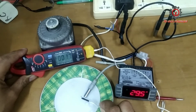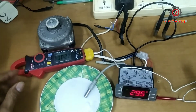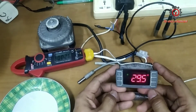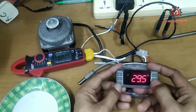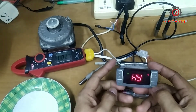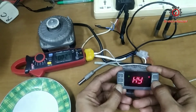Okay, 18 degrees Celsius — the fan is not going to activate. Now to fix this issue, we're going to enter the parameter. To enter the parameter, press the Set button and the arrow down button for three seconds. Then press Set and arrow down button for seven seconds to enter the hidden parameter.